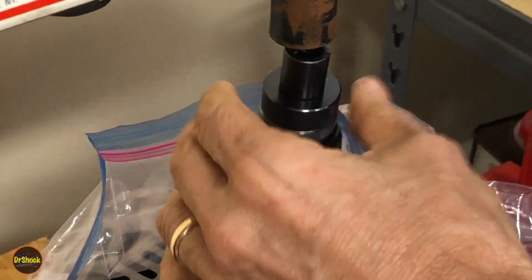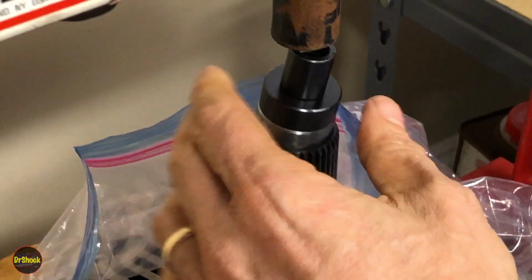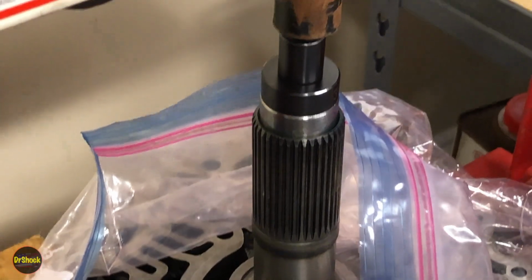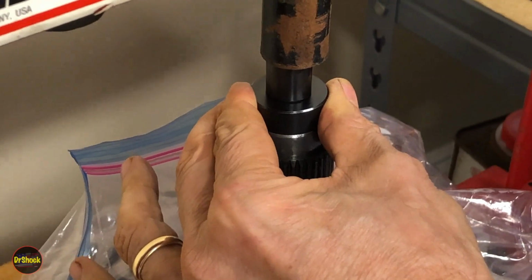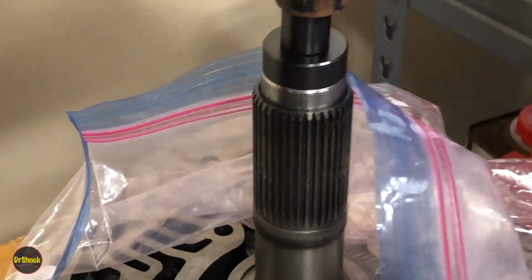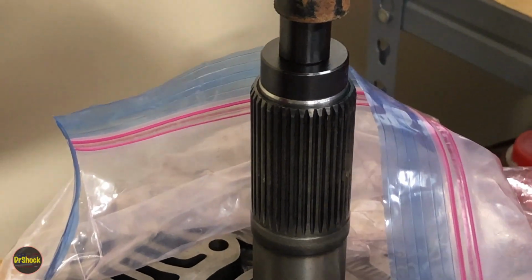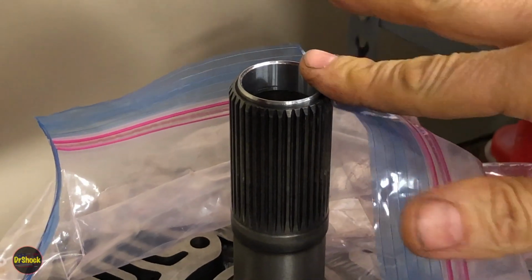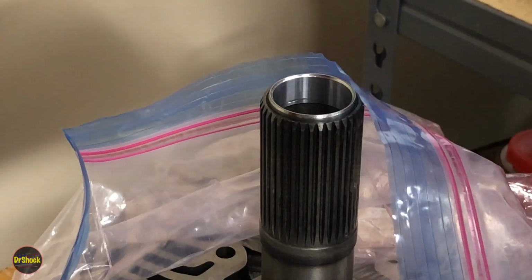So with these small bushings, the ones that are really prone to cocking, I just want to try and get things as centered as you can going in. Now, I'm going to change it to a larger one on the outside to set it flush, and then we'll switch back to this one to push it in. The reason for that is just to avoid any possibility of mushrooming.